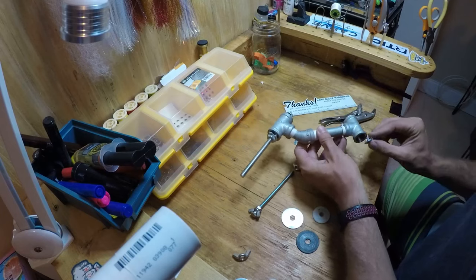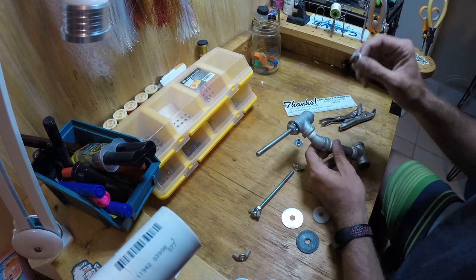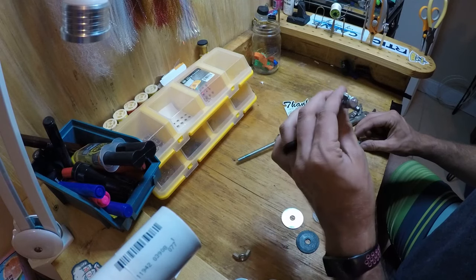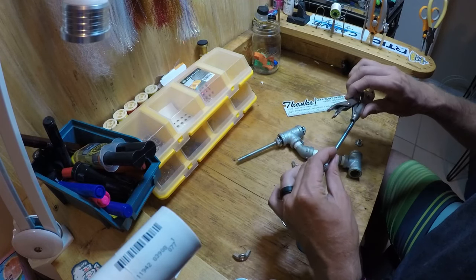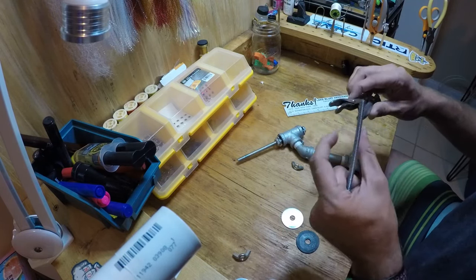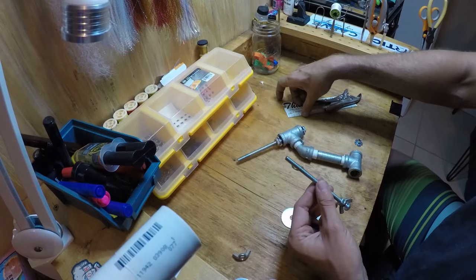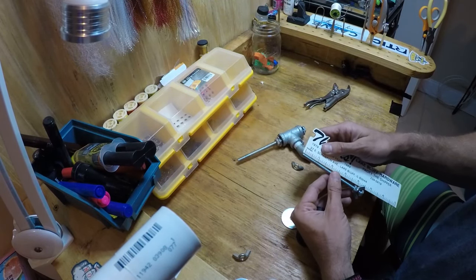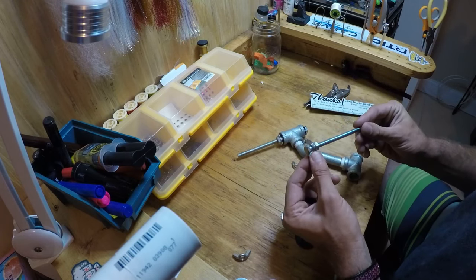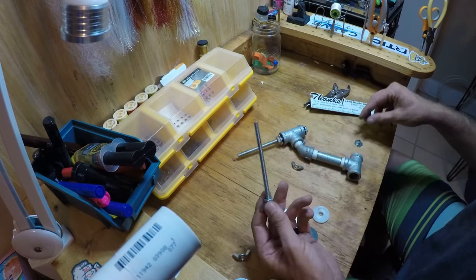But the same methodology of using these T's, or what do they call them, the hammer-in nut plates, I guess, for wood. This is a 1/4-20 thread, and it fits right into my pliers. The end of the pliers has a thread in there. I took the original little adjusting knob out and just found the right thread for it, which is this 1/4-20 bolt, 1/4-20 by 4 1/4 or 4.5. I threaded these on here. This is just like my adjustment handle. It's not really necessary, but this is pretty well locked on there, so I don't want to take it off.